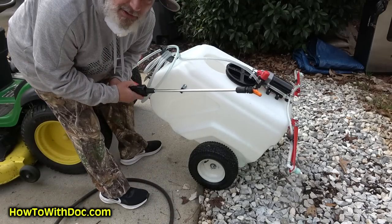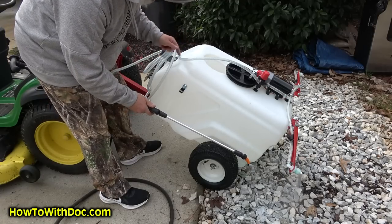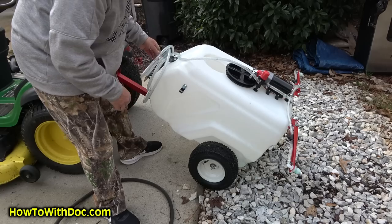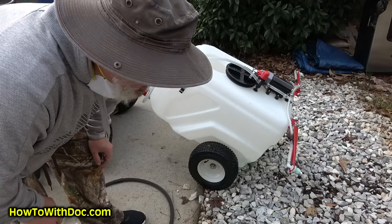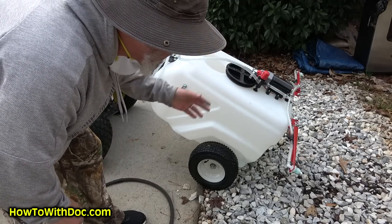Clear out the hand-spray line too. While the tank is still tilted up, take your cap off in case there's any grass or debris inside, let it flow out, and then she's ready to store. Just pull your pins and put it away.